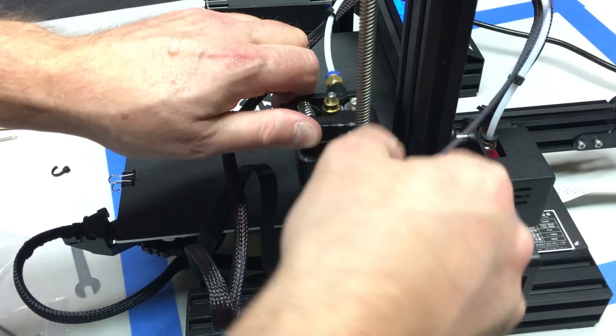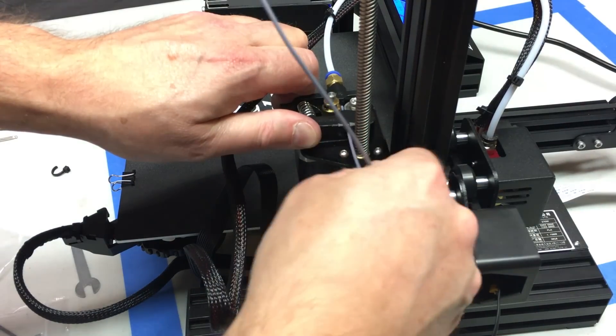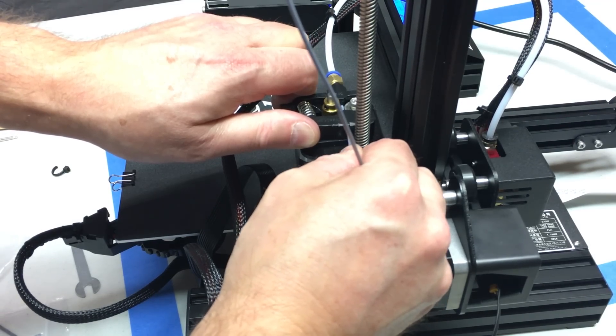That resistance is it hitting the back of the nozzle and the melting area of the hot end. Once you do, shove about another inch worth of filament in. After that, take a look at the nozzle and what you should see is extruded filament — you've been forcing that filament through a heated hot end.